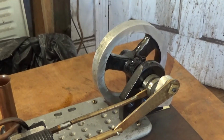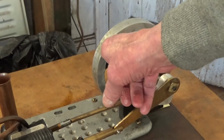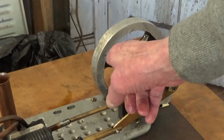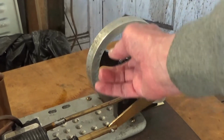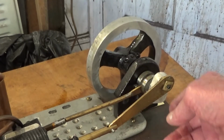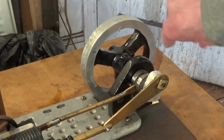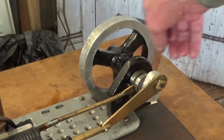So I spent a long time on that, and because it's hard aluminium, there's hard and soft spots. I do have my belt sander, but you don't get it flat, because what happens is you put it on the belt dead flat, but there's a hard bit there, so when you take it off you find it takes more off the soft part than the hard part. So what I did in the end was take that 1 or 2 thou undersize there, if that's a hard spot, and then put it on the belt sander, and I mic'd it up until I got it just about true.